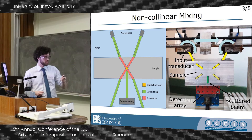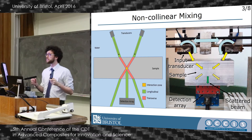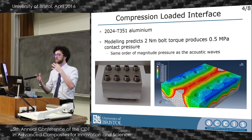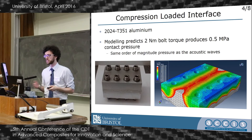What I've been doing to develop the technique is changing the angle of these beams so that the interaction angle between the two beams can be varied, and also changing the frequency ratio of those two beams. The sample I've been working with is two plates of aluminium bolted together to create a simulated kissing bond — it's a very loose approximation right now, just early stages of testing — and I can change the torque on these bolts to change the interface pressure.